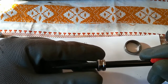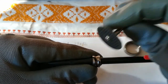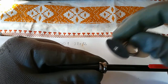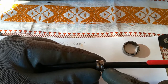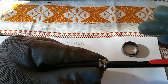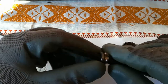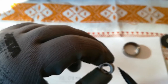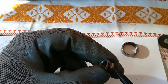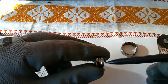So if you have that kind of surface, don't cut it like this — cut it like this. This way there is less chance that you are going to damage that surface. You can also wrap it in aluminum foil or copper tubing or something that will protect it, like sheet metal for example. Go 90% — you don't need to cut 100% of this thickness, you need to go maybe 90%. It's going to weaken the material and with a little bit of heating and hammer and chisel punching, it will come out.